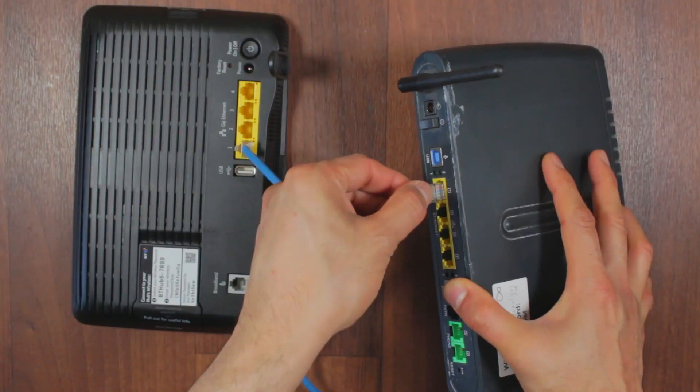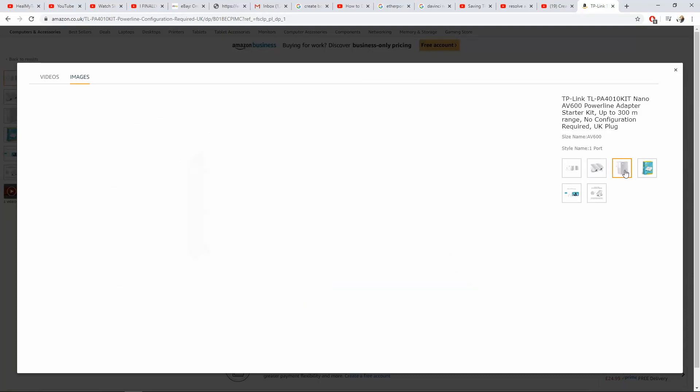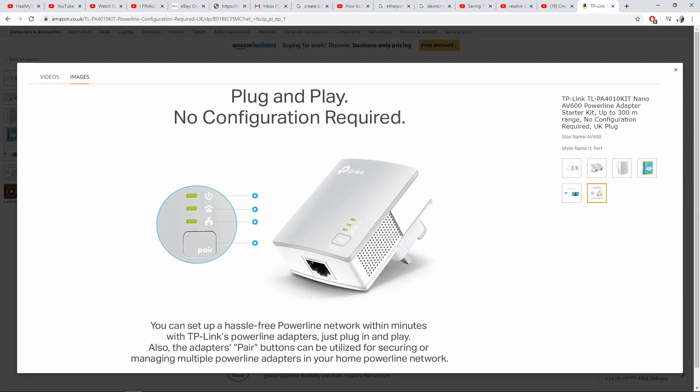The length of this Ethernet cable will depend on the distance between your existing hub and your second hub. If routing a cable is difficult due to building regulations, another option is to use a powerline adapter. These usually come in a pair — you plug one end to your existing hub and the other to your second hub, press the button for a few seconds and it pairs. Powerline adapters work on your electrical wiring system and as long as both ends are on the same circuit you can get internet through your electricity. The cheapest option is the Ethernet cable, but the powerline adapter is an alternative. I would not suggest buying one just to test — try to find a way to run a wire between the two points unless you have no choice. I'll actually be using one today because I already had them, so it's not costing me anything extra.